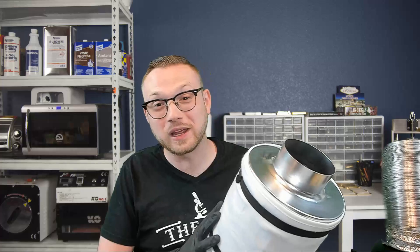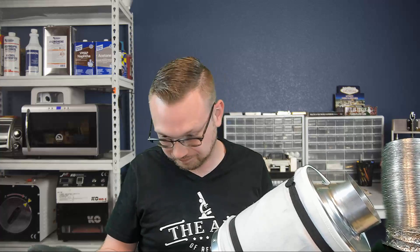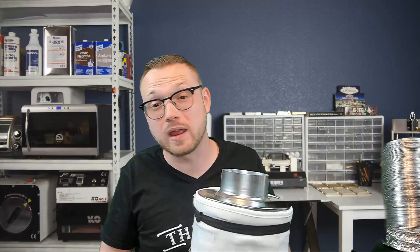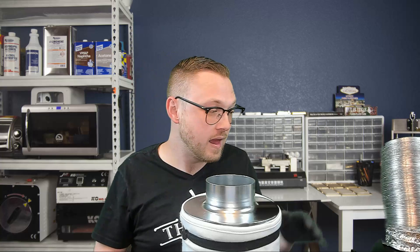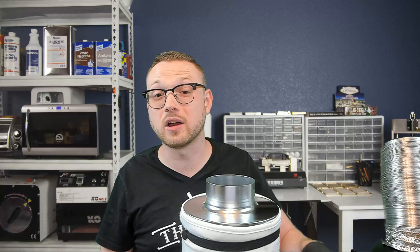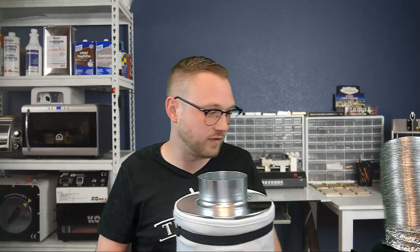This carbon filter is really good at filtering out gases. Normally in bigger stations, you have a split HEPA carbon filter that works both angles. The carbon filter itself filters down to about half a micron, whereas HEPA goes down to about 0.2 or 0.3 microns. If you want, you can still buy an inline HEPA to add on here — it won't hurt anything. But based on the exhaust fumes that come off your work and the size of this carbon filter, I don't think you're going to have any issues.